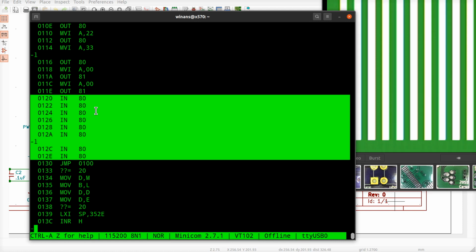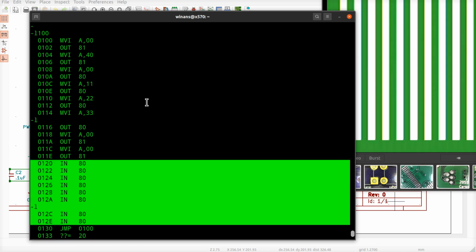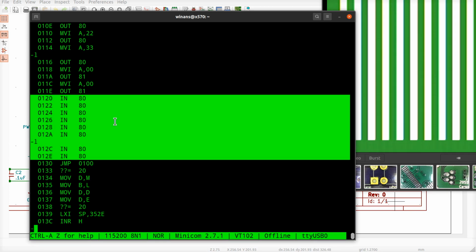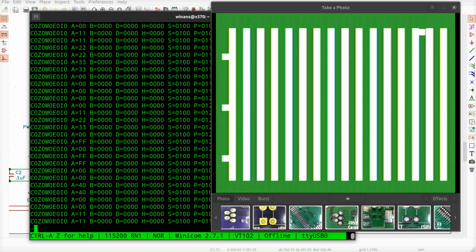So I'm going to go ahead and run it by tracing it rather than just running it and then returning back to the OS. And we can actually say trace. I don't know how many instructions there were. What does it do? List up 8 at a time. 1, 2, 3, 4, 5, 6, 7, 8, 9, 10, 11. 11, huh? Yeah, that's a weird thing. 11, 22. Let's just trace 22 instructions. And if it prints everything out, it's going so unbelievably slow, it will be relatively safe.